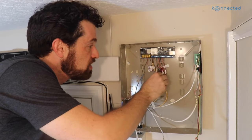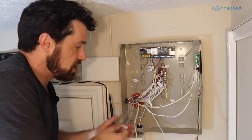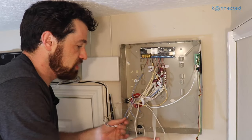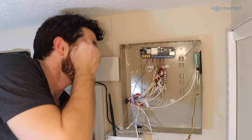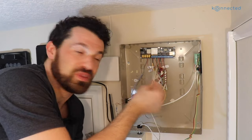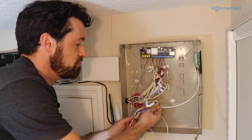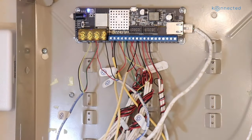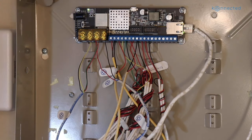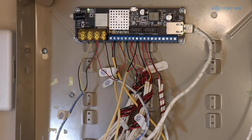That's all it took to convert all those wires from the old system to the new one. We still have dangling wires for the old keypad, from the AC power which we're not going to use, and from that communicator which we'll eventually remove. But we've got our siren and all of our sensor wires hooked up to the Alarm Panel Pro. Here's my Ethernet cable connected to a PoE plus switch in my network closet. All I have to do now is plug this into the Ethernet port and watch it power on — plug in the cable, see the blue light come on, and it'll blink as it obtains an IP address from my router.